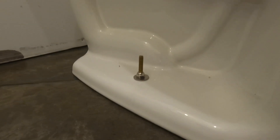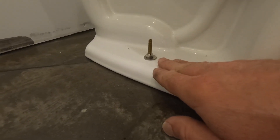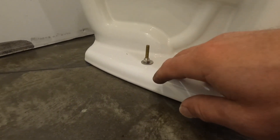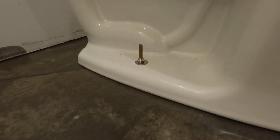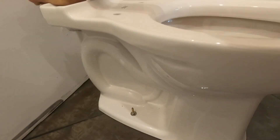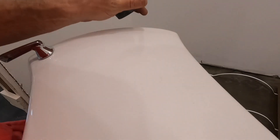When you're putting the toilet on — whether you're using a wax ring or one of these — you want to put downward pressure on the toilet as you tighten these bolts. You definitely don't want to over-tighten as you could break the porcelain. This toilet's on there snug and it's solid, and that's what we want.